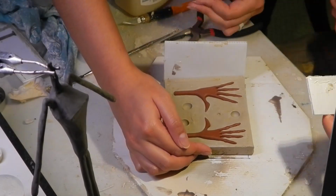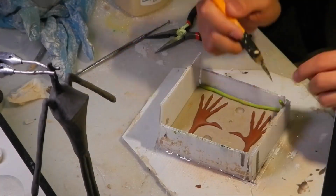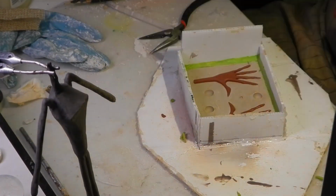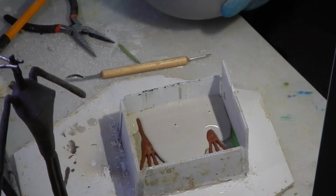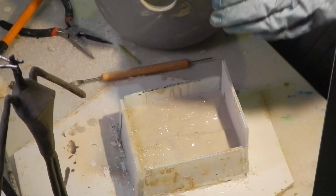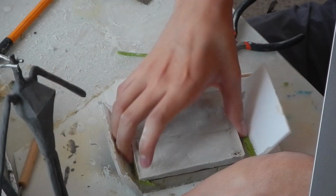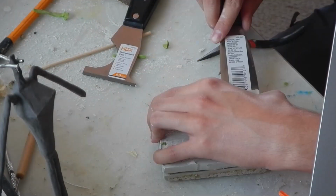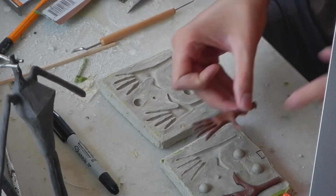We rebuilt the container box, placed the mold inside, and glued the walls together. Then we sealed the edges with plasticine, applied a coat of Vaseline on the mold surface, and casted more ultracal. Once more, adding a little piece of burlap in the middle of the cast. Later, we tore apart the plastic box, opened the mold, and very carefully removed the plasticine hands from the inside.